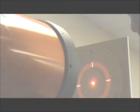I said, adjust. Do you see it moving? Yeah, I see it. Adjust the corresponding secondary mirror adjustment screws to line up the 3 dots on the collimator target onto the same track. But I do see it. Yeah, well, I'm barely turning it. Okay, now I'm feeling some pressure, so I need to loosen up some of these.